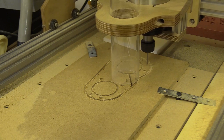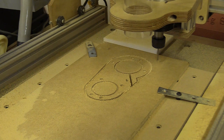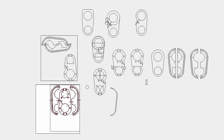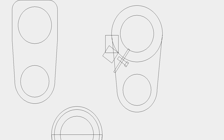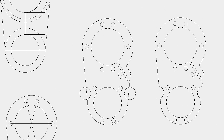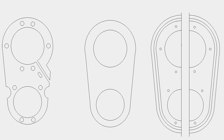I'm cutting out a practice piece of 9mm MDF to check the design before I use more expensive acrylic for the final version. I made this design from scratch using an older version of Artcam, however this version isn't available anymore and the subscription software is really expensive. But you can create vector files for CNC using software like Inkscape for free.